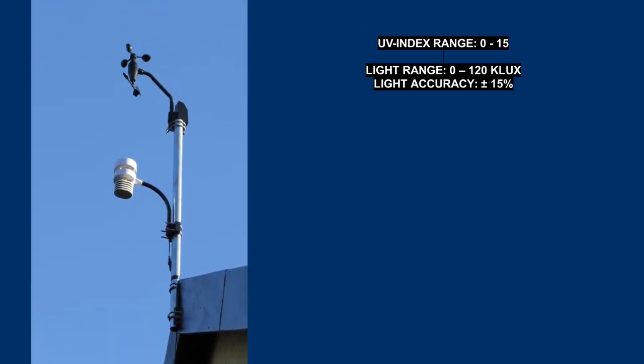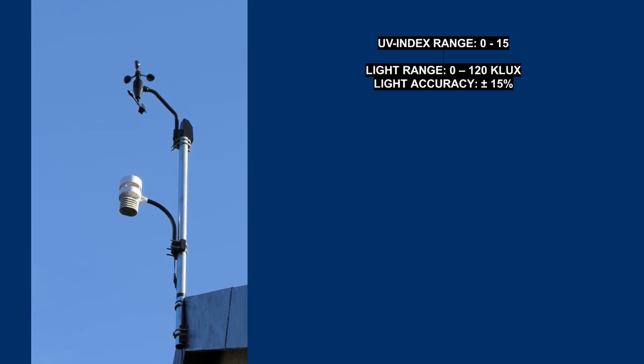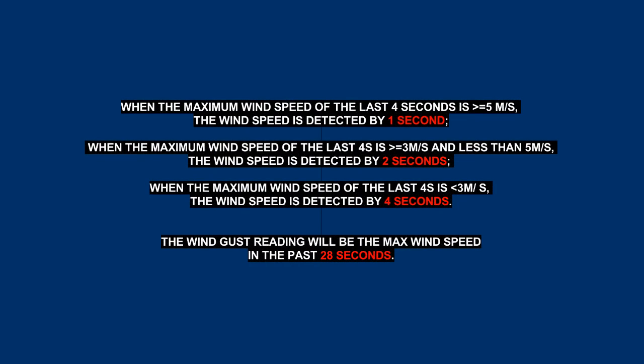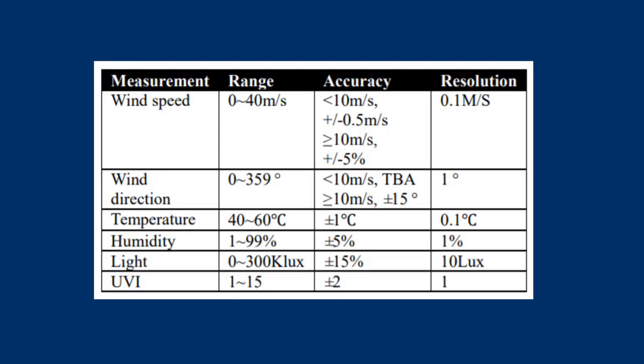The sampling frequency of the wind increases with its speed. When the maximum wind speed of the last 4 seconds is higher than 5 meters per second, the wind speed is detected every 1 second. This accuracy of measurement makes a big impression on me because compared to a classic anemometer, I can see much better detection of wind gusts, and I see wind readings on the console updated even less than every 5 seconds. Great thing.